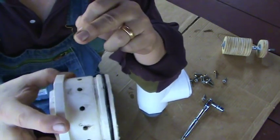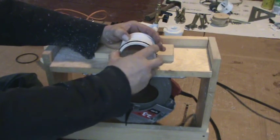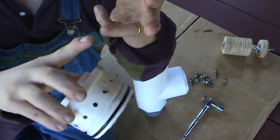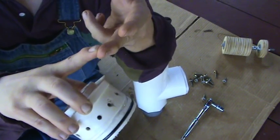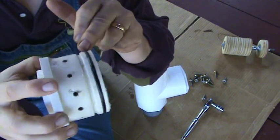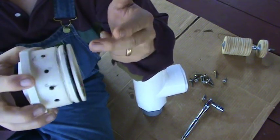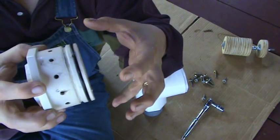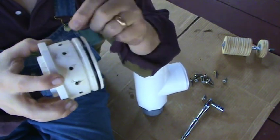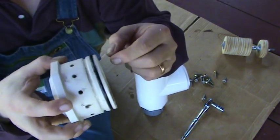The other pain is I have two O-ring grooves in here — I screwed the first one up. Getting an O-ring correct without the right equipment is a giant pain. All of this was done with a skill saw, a drill, and a belt sander — that and some hand tools. I don't have a good shop, so anybody should be able to pull this off if I could. By the second time I put an O-ring here and with more practice, I managed to get a pretty good fit — about a 99% seal. There's a way to make these O-rings less deep so they'll pooch out a little bit more: take some nail polish or paint that'll stick to plastic well, take the O-ring out, put a couple coats under there, and it actually makes the O-ring a little bit bigger. Put the O-ring back on — it's tighter. So there are ways to play with the fit after you get it built.